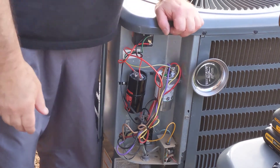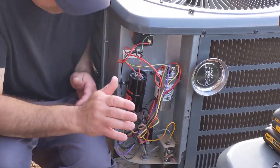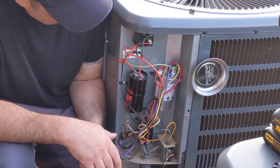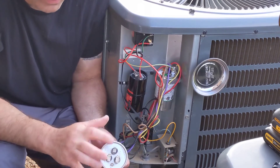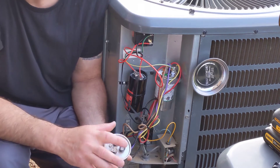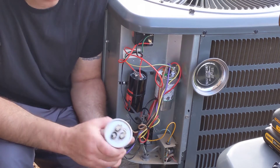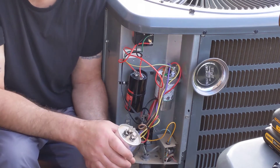That is like super quiet! Before I installed this it was so loud trying to start up. It could have been the cap — I'm going to test the microfarads on the fan and the herm terminals just to see if this cap was about to go out. But even if the cap was still good, the hard start kit could have been the thing that really did the job for me.